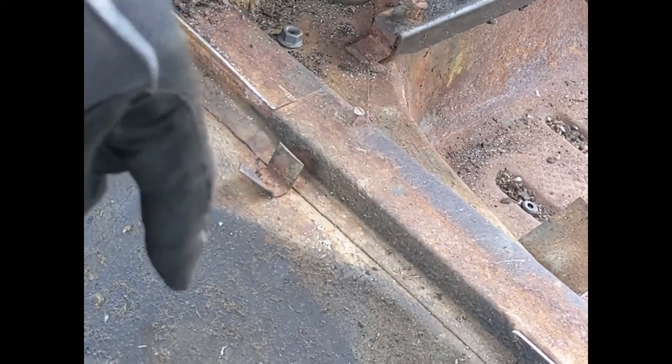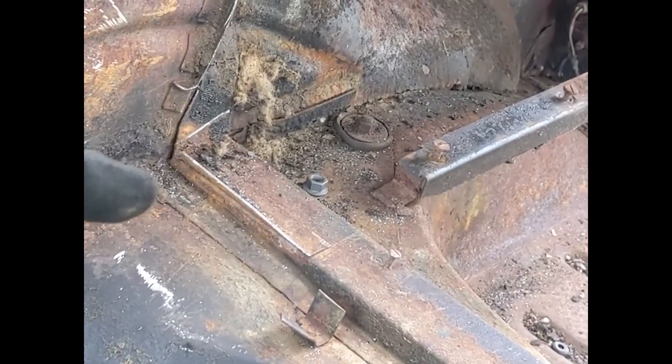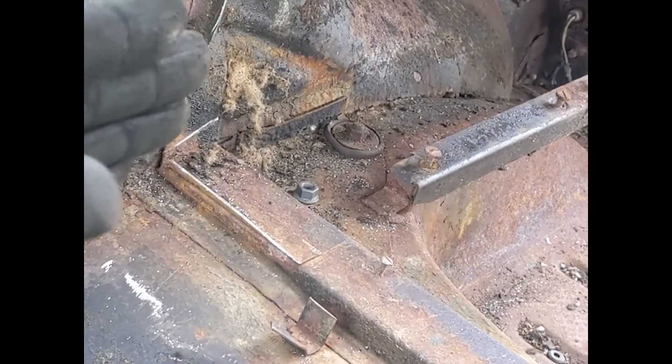This spring pocket's right about here. You can kind of see the little indentation of the crossmember that's on the frame. There's your little hump for the axle. So I'm going to cut all of this out on both sides so that my shock has clearance to come up through here. There is a crossmember on the actual frame that is shaped just like this stamp in the body - I'm going to weld to that. Because being a body-on-frame vehicle, I don't want to weld the suspension to the body since they're not really a structural piece - that would probably blow the windows out and just mess a bunch of stuff up. So we'll get that clearance, drop the shock in there, and kind of see what we're going to have to do from there. Half the fun of these kinds of projects is you just make it up as you go.